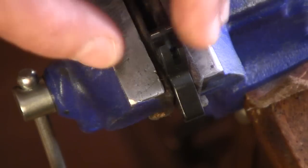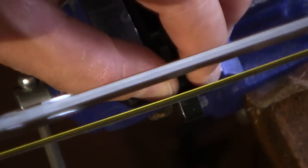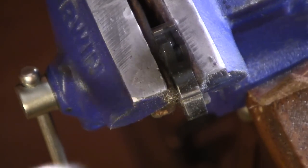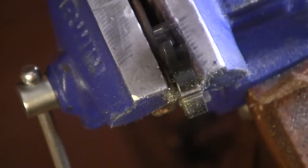I'll use a hacksaw. The hammer was actually case hardened — or surface hardened, not through hardened — because my hacksaw was struggling a little bit and the part got really, really hot. But I was able to cut through it. Later when I was filing, I confirmed that the outer sides of the hammer appear to be hardened.